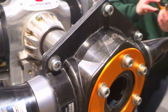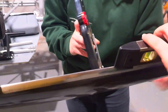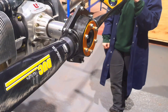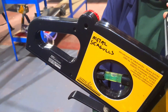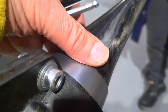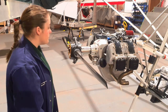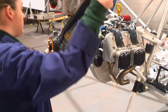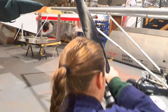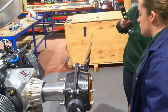Having snugged in, we've not yet torqued those middle bolts. We're going to come back now and check that the pitch has not changed in tightening up. Having done the tightening to the middle — not torqued but just nipped in — we've gone back to check the pitch hasn't moved. If it has moved we would readjust it, and knowing this one is now secure and good, we're going to nip up these bolts before doing the other blade. We then use this blade to turn around to get to the other blade.